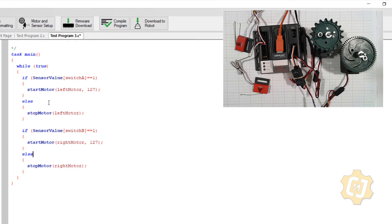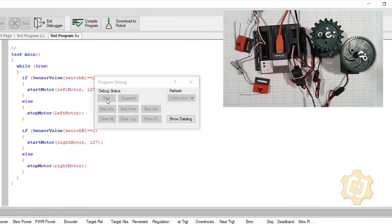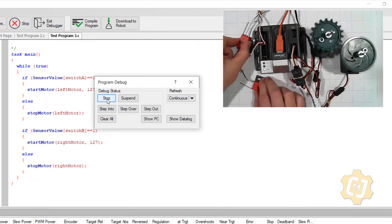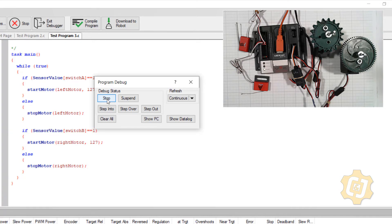So it's really nice that I don't have to put anything else with it. If this condition is true, do it; if it's anything other than that condition, then stop doing it. So we'll download the robot and hit start. Awesome — that's what we want. So we can have multiple ifs, we have to be careful about having things outside of the if statements that are inside the loop. We can have an if with an else — in pairs or banked together.